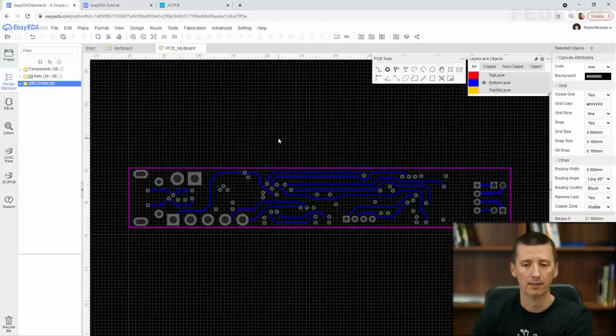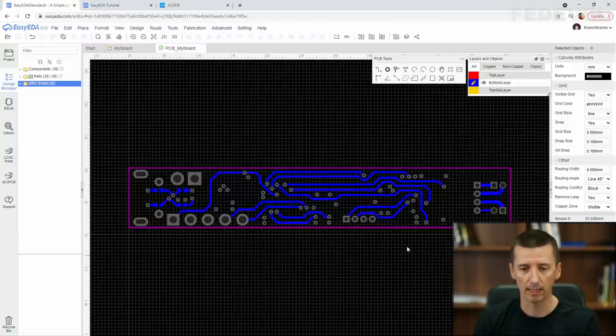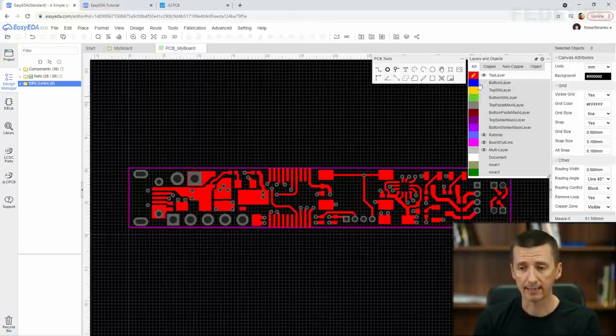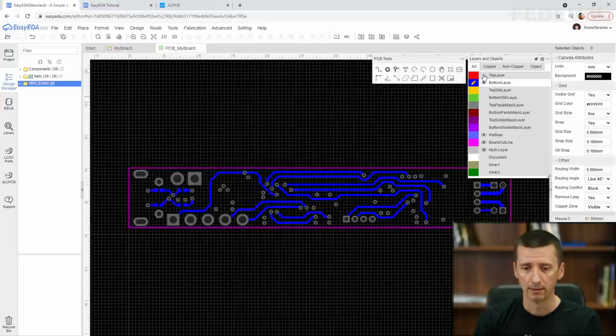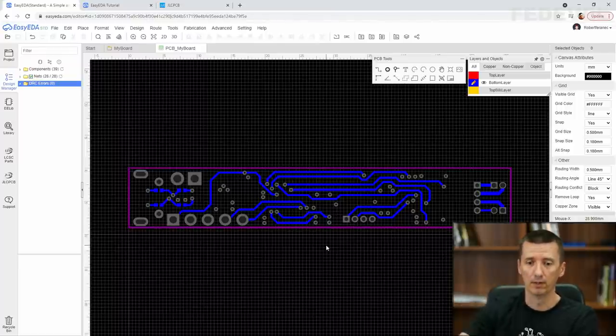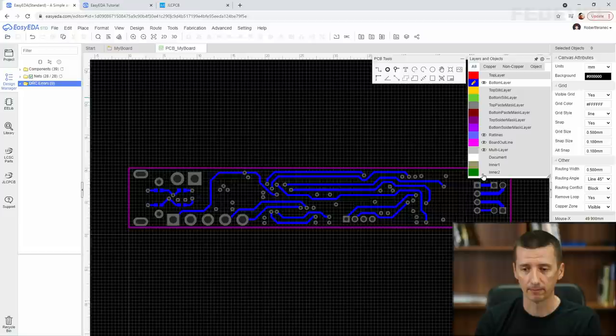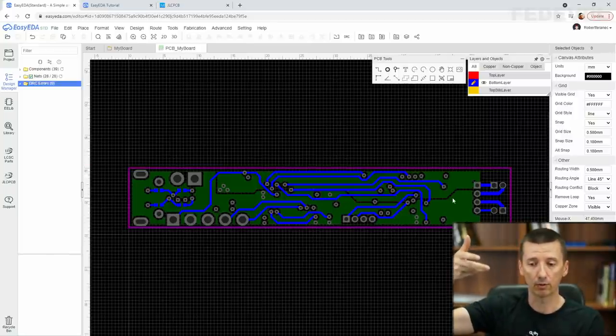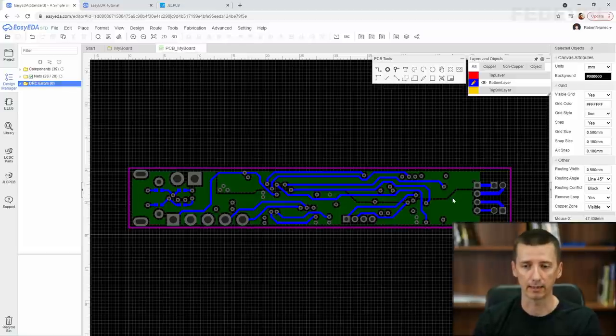And when we have a look on our PCB, most of our tracks are routed on this bottom layer. On the top layer, there are components, but not like many tracks routed. So that's the reason why I decided that maybe it would be good if on our layer 3, that's the layer which is neighbor layer of this bottom layer, if on layer 3, on this one, we have very nice solid ground plane. At this moment, these are the power planes, so we will move the power planes on layer 2, and we will take the ground plane on layer 2 and move it on layer 3.